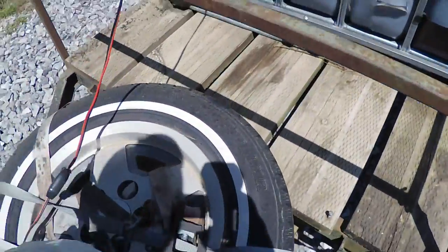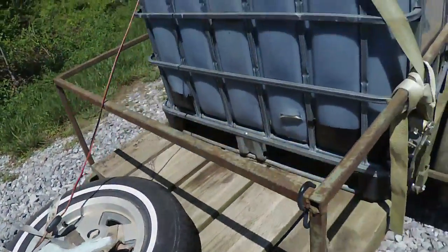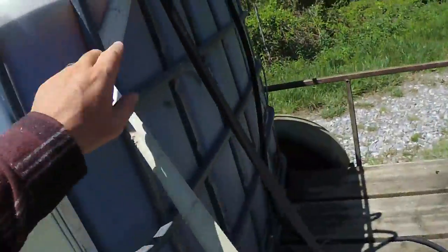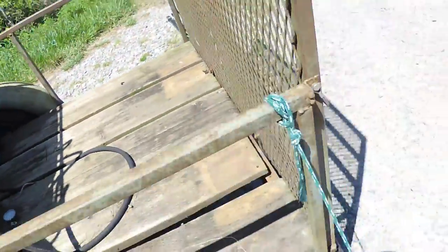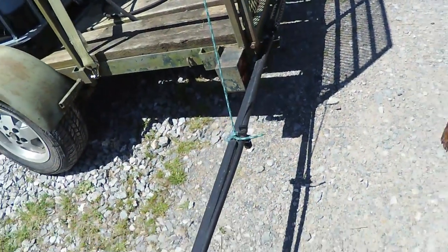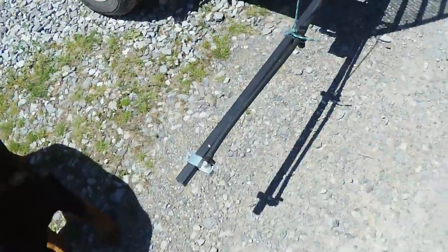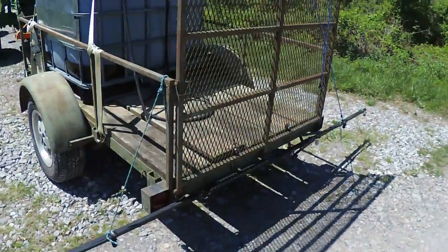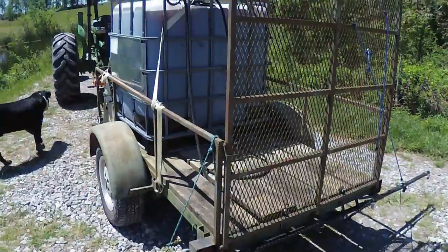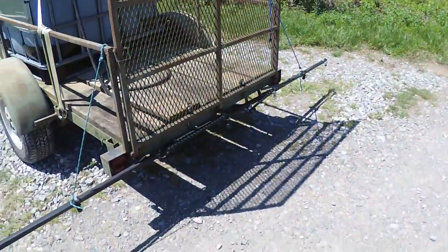This bag — it's not a bag of trash. I usually leave it up on top. It's a bunch of random fittings and parts for sprayers. Because with all these little tees and such being plastic, and with all these sprayer tips being plastic, stuff gets brittle as it ages and breaks. I caught this bracket on a fence recently and pulled it off and it snapped that fitting. So it's nice not to lose a day's work — it's nice to be able to just in a quick five minutes swap the broken plastic pieces out and get back to work.